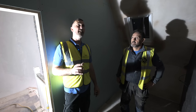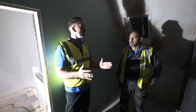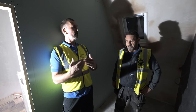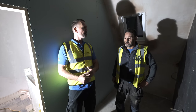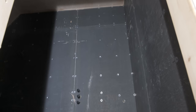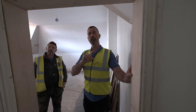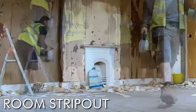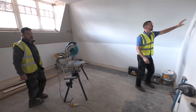The aircon ducting was a massive thing to overcome. The size of the ducting was something like 350 to 400mm by 180mm, and you've got to incorporate the insulation that goes around the duct to prevent sweating. Finding that extra space was huge — we had to borrow and steal space everywhere we could. We also put a new lining in and utilised the existing architraves. We're doing the whole top floor in existing architraves and skirtings.